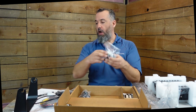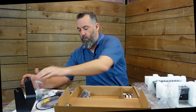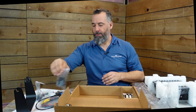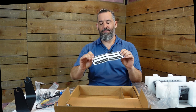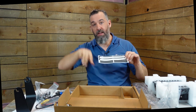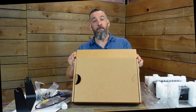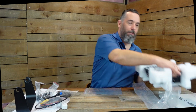Also in the box are the knobs that go on the sides of the trunnion U-bracket, which hold the display if you're not going to flush mount it. There are also ferrites that can be installed on the cables - ferrites help stop electromagnetic interference. Lastly, there are foam pads for when you're mounting the display on the dash, to make sure it's well-sealed around the cutout, since these displays are marinized for outdoor use and you don't want water coming down the hole into your boat.